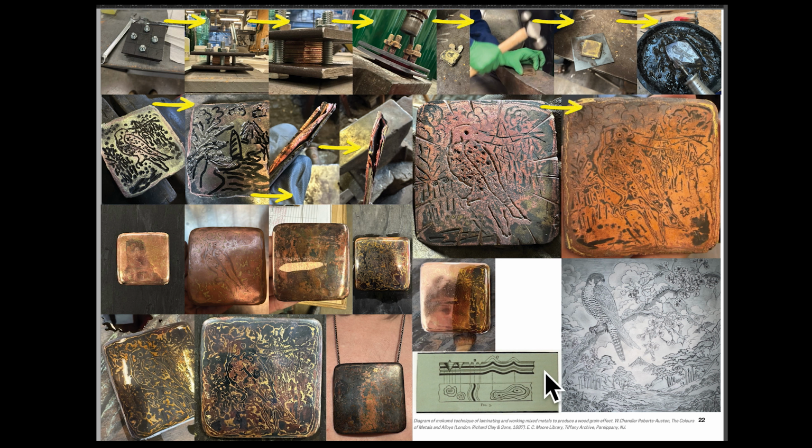vase, and it shows the different ways that you can pattern Mokume, because this is the 3D cross section of the metal, and this is what it looks like from the top once it's been flattened. So you can bore into it, and the amount of layers that you go into it, then when you flatten it, looks like this. So all of these channels were dug out with this carbide bit into the pattern here,